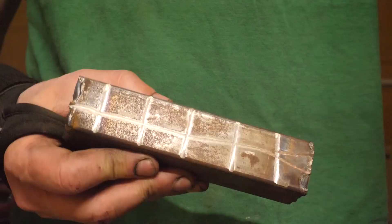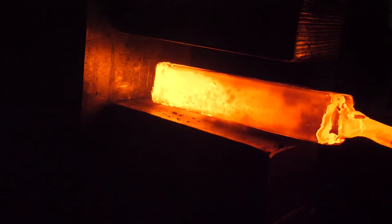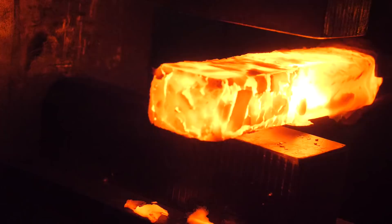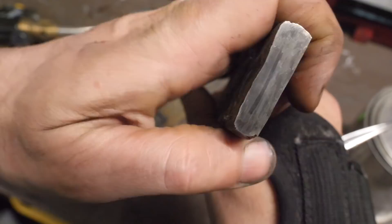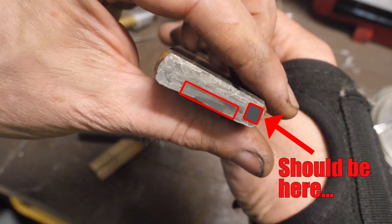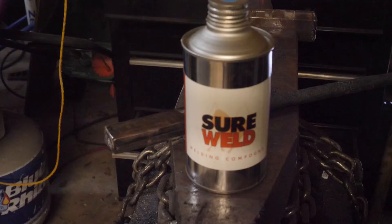I'm going to mark up two sides of the canister to keep it indexed. These markings indicate the plane the blade material is in, and I smoosh the other two sides. Oh look, it did matter — it's all wrong now. I guess that's why I indexed it in the first place. Actually, with an extra step, this is still salvageable. We're going to cut the billet in half, fold it in on itself so the core material is in the middle, then grind down to it. We'll still have usable blade material.